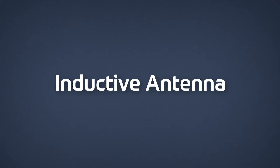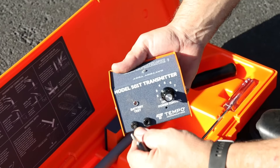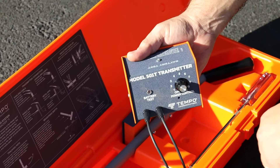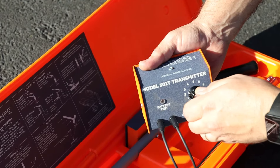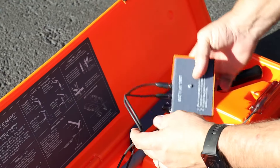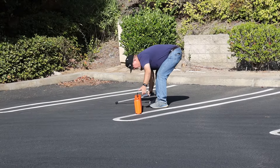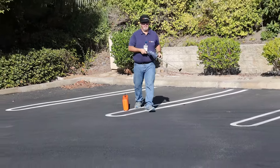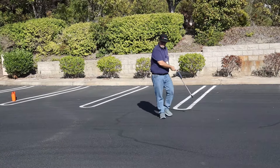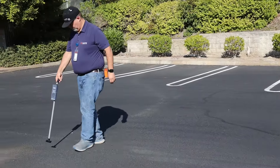The Model 501 provides a fixed antenna located inside the tracker case. Connect the transmitter to the two leads located in the center tray of the carrying case and set the transmitter output to the number seven position. Place the transmitter rear-facing in its storage slot and close the case. Place the case on the ground within about one foot of either side of the wire to be traced, then radius the area approximately 20 feet away from the carrying case.